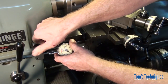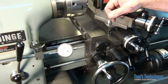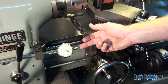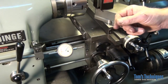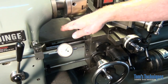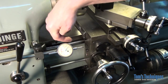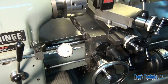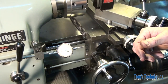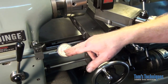This should be a pretty simple project and it's very useful. Unlike a micrometer carriage stop, it's not a hard stop — it's what I call a soft stop. In other words, you're just reading where the carriage is rather than stopping it, but it's very quick. I have a micrometer carriage stop for this lathe that clamps onto the bed with a dovetail bracket and a micrometer spindle. I use that occasionally for running a lot of parts in one operation, but for general day-to-day use if you don't have a digital readout, a dial stop like this is pretty handy.